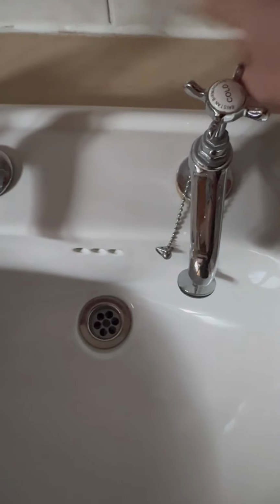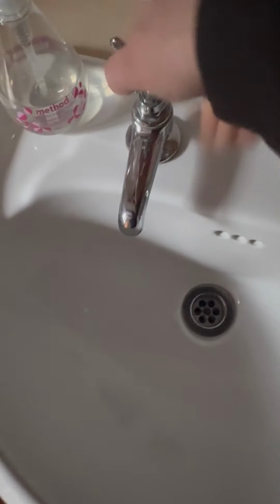And look at all of this scrap pipework, because the heat inside has all been disconnected a long time ago and they've had storage heaters fitted, and that is what they're going for going forward. So we're getting everything drained down, and as you can tell by the bath, the cold is off of the tank in the loft, so we need to do something about that. So we're getting it drained, and I'm going to be taking out all of that heating pipe.